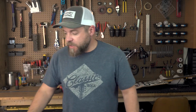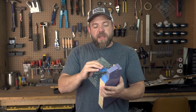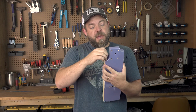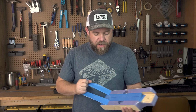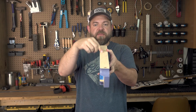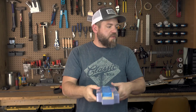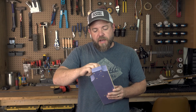The one thing I failed to mention was that the other thing we're going to have to do on these, I guess this tape can come off, is we need to shave the top down by the width of the skateboard. So I'll need to measure the skateboard, and then I'll take these over to the table saw, get whatever we need to shave off, put it on the table saw, and I'll run it through that way, and then I'll flip it over and run it through the other way, and we'll do 2 cuts that way, and that'll take care of that.